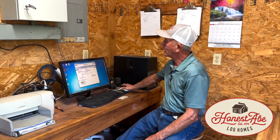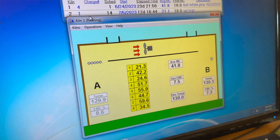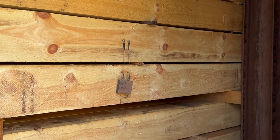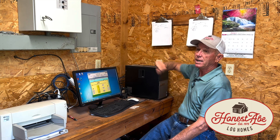You can see the computer here — it tells me what's going on inside the dry kiln. I can look and change settings to see when they're venting, if it's heating up, if the fans are working. All the numbers tell me what each of the little probes we've driven into the logs are reading. It will tell me the moisture content in each particular log at that particular time. We have a record from when we started to show how much moisture was in those logs, and a record when they come out showing what we worked it down to, to have that log dry enough to go into your home.